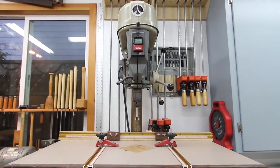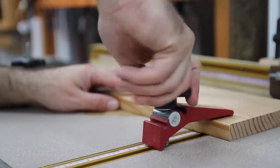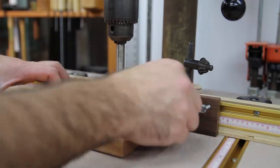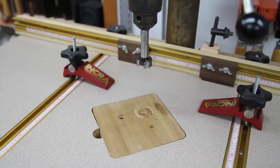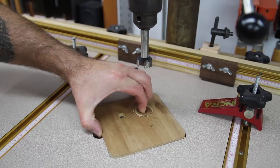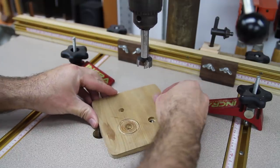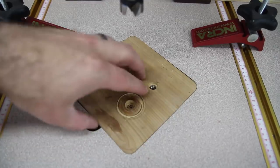Drill press. This old cast iron beast is a Rockwell drill press that came from my father-in-law. I built the extension table myself with a scrap of laminate countertop material and of course some Incra hardware. I made hardwood stop blocks and included a little notch in the corner so sawdust doesn't interfere with your measurement. This is the sacrificial insert for the middle of the table — it can be used as a zero-clearance insert behind your stock so I can drill all the way through a piece of wood cleanly. The diamond shape allows me to turn it four times before I need to replace it. It's supported underneath with four leveling screws.